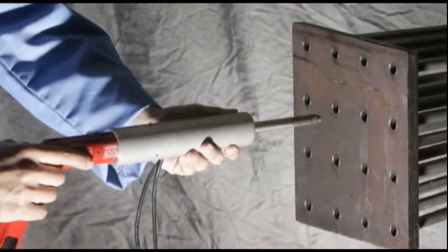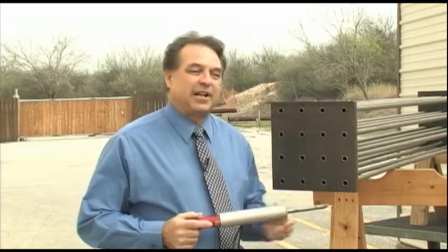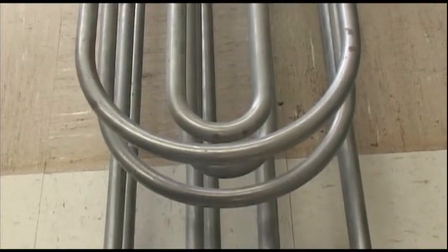What makes the MSS heat exchanger probe better is that we only have to clean the first six to eight inches of the tube. It allows 100% inspection of all the tubes versus the conventional process of sampling. The sampling can miss tubes that are dangerously corroded.